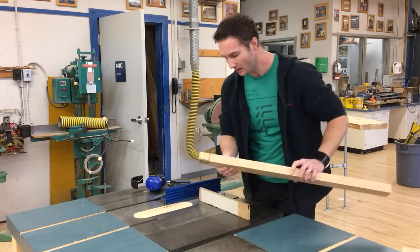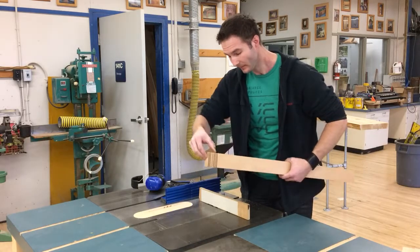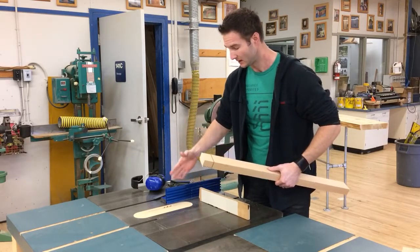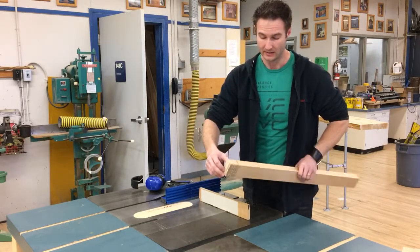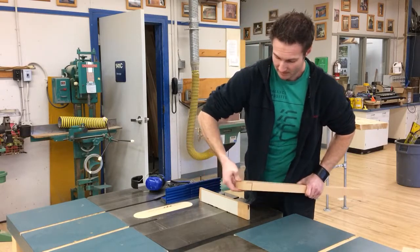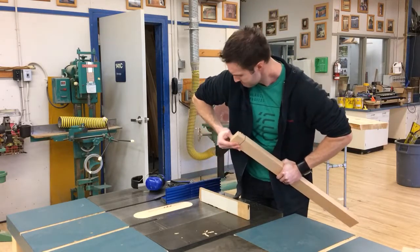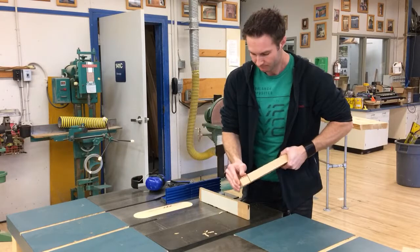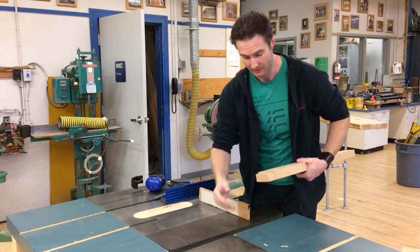There you guys can see I've gone all the way around with my shoulder cut and it should line up perfectly all the way around. That's the beautiful thing about using this stop block here. When I was ready to start wasting away the bulk of the material from the tenon, I just made this series of saw cuts, and you can just go along and break that off after. I cut that one a little thick — you can just use a hammer and knock that off. You can cut them a little smaller if you want; it just depends on how fast you want to go.